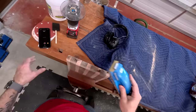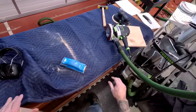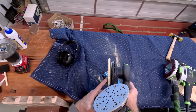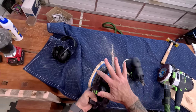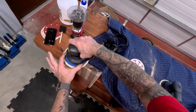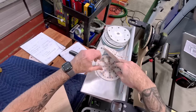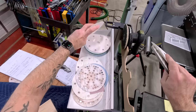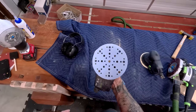For this end grain, absolutely you can use a hand sander to get this done, it's just going to take a long time. If you are lucky enough to have a sander with a hard pad — most Festool sanders come with this — that's going to give me a much more rigid surface and something that's a little bit easier to keep flat on something that I don't want to round over. So I am going to use this to speed things up. Just a big old pile of random papers in various states of use because in my shop, paper's not dead until it's dead.